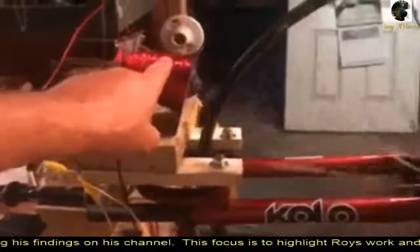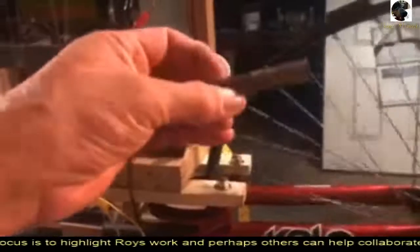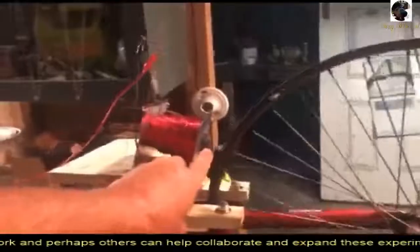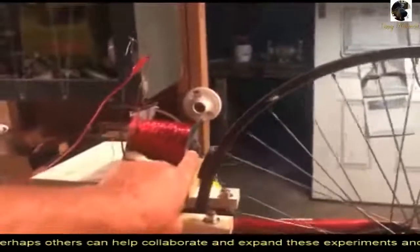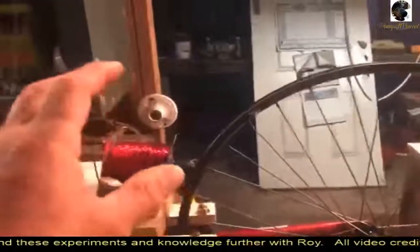So this is coil number 1. The core I have there is a laminated core, and it's the core that comes off the microwave transformer, the MOT. It has a bunch of these on there that you can pull off. And what I did was, this is a 3/4 copper tubing, that long. And I have the core pushed all the way through, nice and tight, and sticking out one end, flush on the back side. For my coil windings here, I took apart 2 Tesla coils, and I proceeded to address these coil windings like I was rebuilding a Tesla coil.